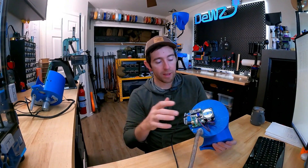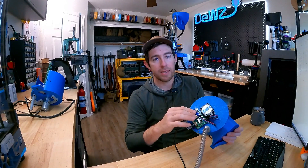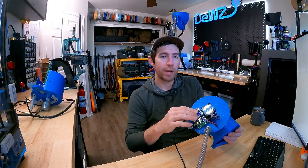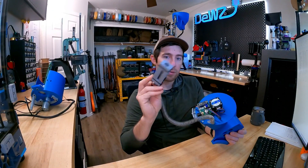The second big thing is that it's got the onboard circuit board. Now we just have one barrel jack right here on the side that gives it 12-volt power, and onboard we step that down to 5 volts for the nano and the TMC 2209 driver, which drives the optical feeder stop switch as well as the motor.